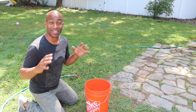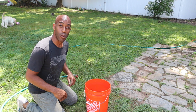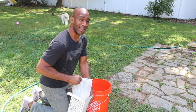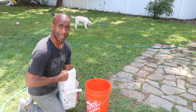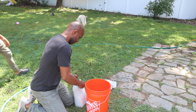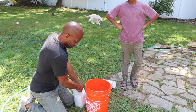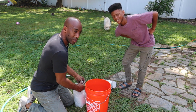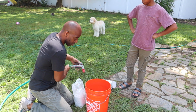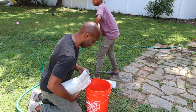Alright guys, so I got the cement tile sealed over. Now I'm getting ready to install my grout. We're going with a light gray grout with the recommendations of the cement tile shop. Yes, 'cause they said that lighter was better. Because cement tiles are porous, and if it was a darker grout, then you would get stained, and we don't want that. You still have to seal it like we did, but you want to use a really good quality sealer, non-water based.